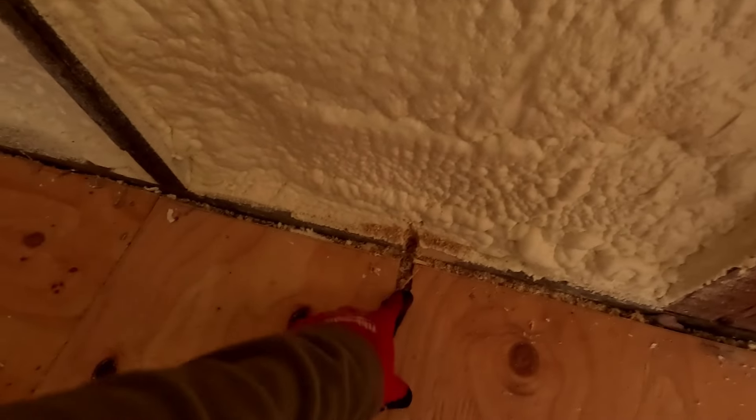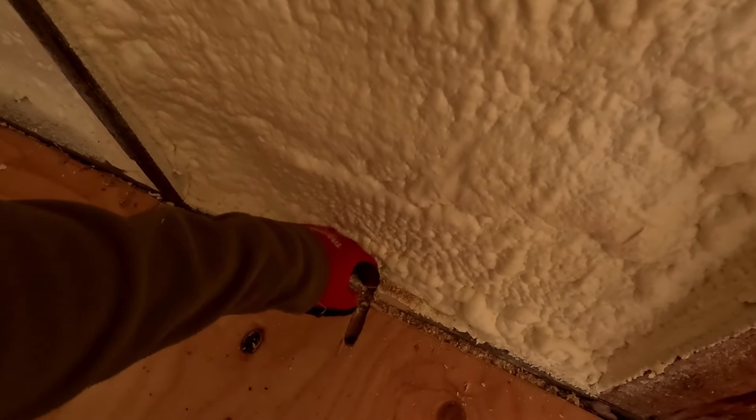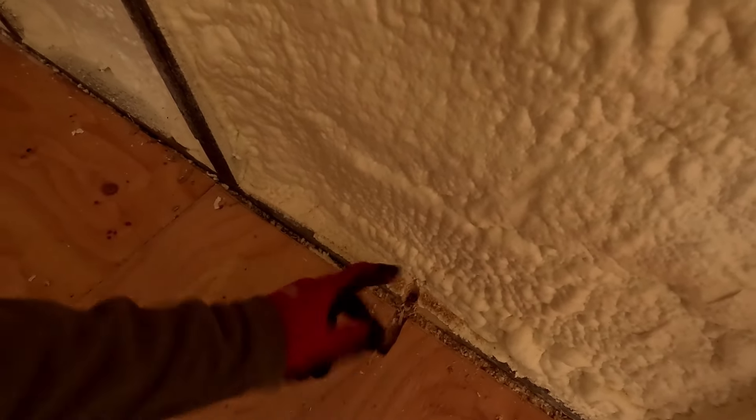This right here is where the wires are going to come up for the 110 and the monitor, and over there is the same thing. Believe it or not, the floor downstairs is overlapped by that top sill by this much. So this is the closest I could get it — if I went and drilled down through here, I'd be drilling right into the top edge of that plate and it would go nowhere except into foam. There was nothing I could do about that. If I was going to do something more demanding for power, I would put in conduit and all that stuff. But the way my calculations work out, there's not going to be a whole lot of draw.